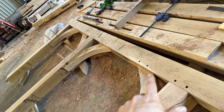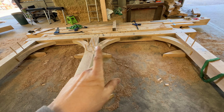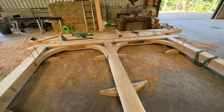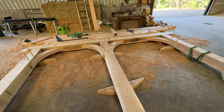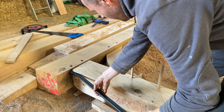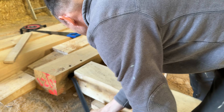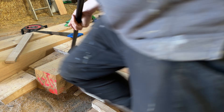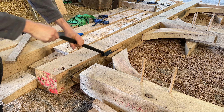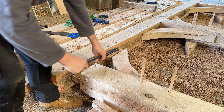When I assemble it on site I can mess about getting these joints dead perfect for that final fit. Got a busy day today — I've got to disassemble this one, make up another frame, get that checked over, and also get some materials ready for tomorrow. Got to do a bit of concrete tomorrow in preparation for fitting this frame. When I'm levering with this crowbar, it's in the centre of the end grain joint so you don't see it. If I've got to do any levering on the other one, I'll just use a sacrificial batten behind the bar or do it in the shoulder line again.